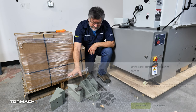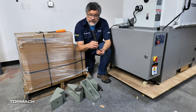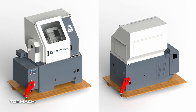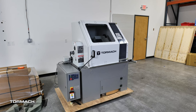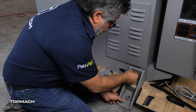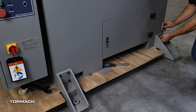The preferred method to lift the lathe off the pallet is to attach some lifting feet — we have four. It's the set part number 33269. It comes with the four feet, the pads, and four screws. To get them on, you need to take a sawzall and cut a strip of wood all the way down the length of the pallet on both sides and up against the supports underneath. The lathe is now shipped on a wider pallet so cutting notches at each foot location no longer works. Secure each foot with four sets of socket head cap screws, locking washers, and washers. Repeat these steps at all four lifting foot locations.